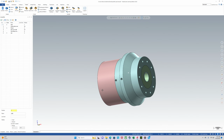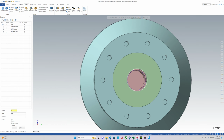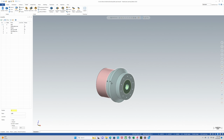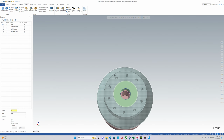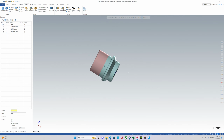that holds the solid model into the fixture, and then we'll have a big bolt pushing the cap into the fixture, which will push the cap into the part, which will pull it to the fixture. And then from there you can just probe around here, put your quarter 20s in, go 3+2 mode, put those in, and put those in with all the clearance for your tools you'll need.